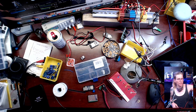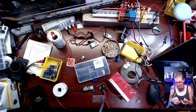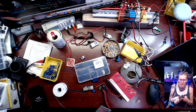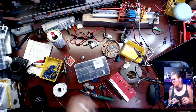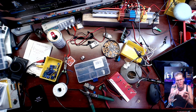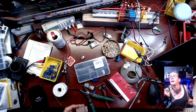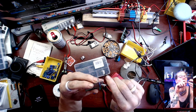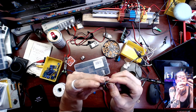Use these pliers to hold the insulation so you can cut it properly, or strip it properly. Hold the insulation so it doesn't come off the wire. That's short, a pain in the ass. If that's the case, then take a blade. Although you don't really want to do this with stranded wire. You're totally fine doing it with solid core wire. And then grab some tweezers. You don't have to get this close. You can just loop them around. It's not a huge deal for it to just be a big loop in the air,